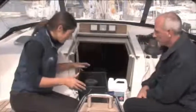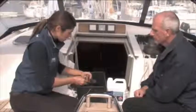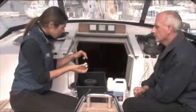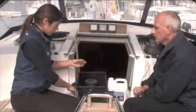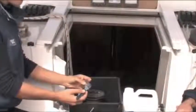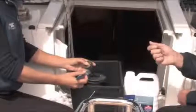Otherwise you'll be leaving it in bits, and tomorrow is obviously another day. To start with, I usually dive in and clean the trickier parts while I've got the enthusiasm to do so. They tend to be the gears with all the teeth — it gets quite dirty inside there. It's worth putting all the parts in the bucket and soaking them in the white spirit, which softens the grease ready for using the brush and getting all the hard grease out of the gears.